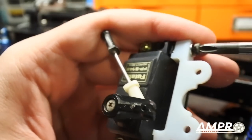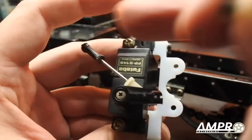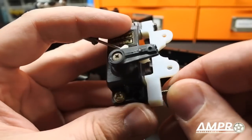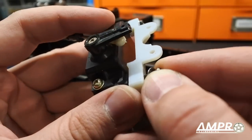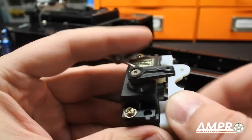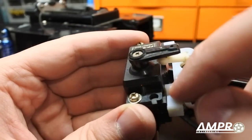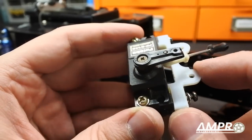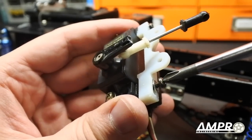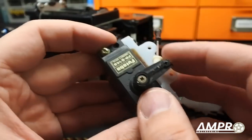You'll notice a couple of little bump stops in here — those are there to prevent warping of the servo mount when you tighten this up. What is happening is the servo mount pieces are going to come into contact with this plate at the same time that the plate comes into contact with the servo. Make sure that you have these aligned properly because you don't want to warp the servo mount. Do test-fit this prior to the final installation.